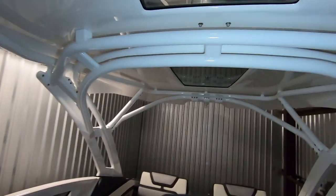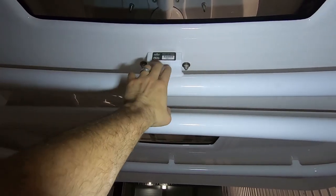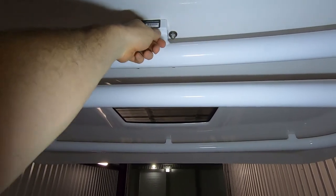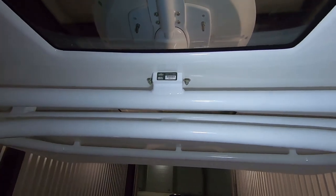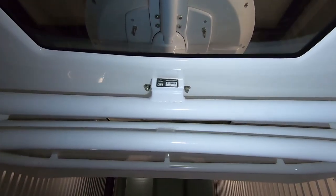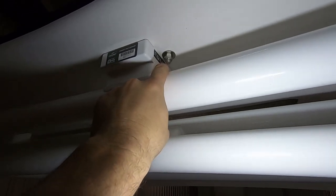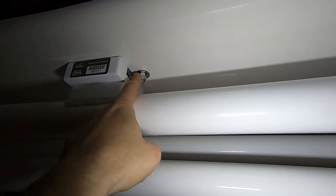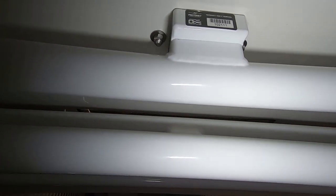When I removed the original anchor light, there was a whole bunch of extra wire Yamaha had bundled and left inside the box — for the anchor light and courtesy lights. That bundle was in the way, so I pulled it out with a hook and it now lives inside my mast. The mast does slightly block those nuts from the courtesy light, but we're still getting plenty of light. I'll put plastic caps on those to cover the washer and nut.